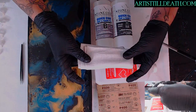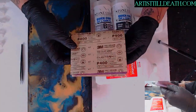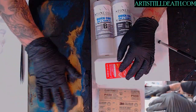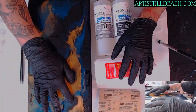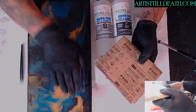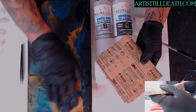This is everything you need for a flood coat: just a regular clean rag, some 91% alcohol, and some 400 grit sandpaper — doesn't really matter who makes it, this is 3M. If you have some bigger dust, like a fly or a good-sized piece of hair that got in overnight, you could use 220. Just be very careful and hit it lightly. Don't try to go through the clear — just hit it lightly until you can feel it's flush, then take the 400 and go over that part and the rest of your piece.